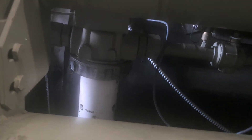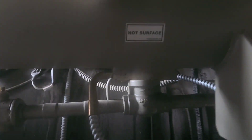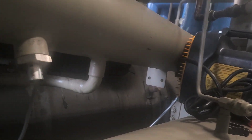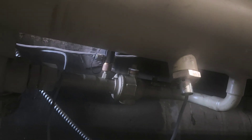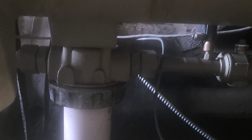After replacing the oil filter, the next step is you have to vacuum down in between your two ball valves. I have the new filter installed. There's one of the ball valves, and this does have a solenoid valve on it as well right here. Then you just vacuum down to 500 microns, and I will probably perform a slight decay test just to make sure that I'm tight.